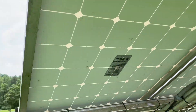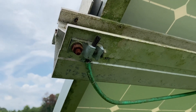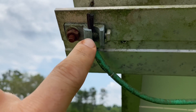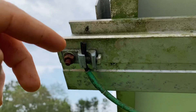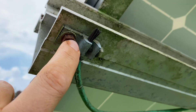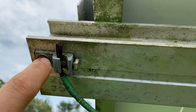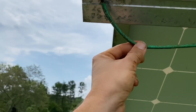I'm noticing some galvanic corrosion on some of the bonding — this is something I see commonly when they don't use a stainless steel bolt. This is a tin-plated copper part called a Weeb, used to bond everything together. There's a stainless plate in between with teeth that break through the anodized coating of the aluminum, but the fastener used to attach it was not stainless. It's still holding tight, but I would have used a stainless fastener on the Weeb.